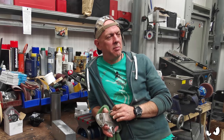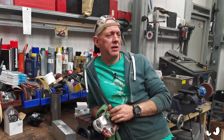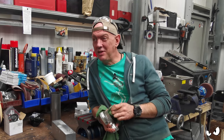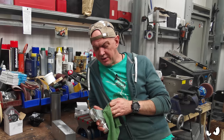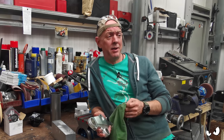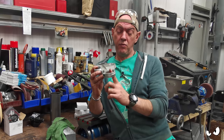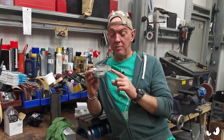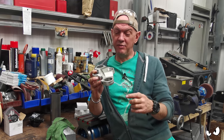So you can look at a bike and you think, well, the forks are just parallel to the steering stem, aren't they? And you look at it and you think, yeah, it probably is. Well, it ain't necessarily. The old 99 R1 that I had and the 2000, they were all straight yokes, didn't have offset yokes, but it was screaming out for a set of offset jobbies. And what that basically means is that your fork leg comes down here and your steering stem comes down here, but you can offset them. So the angle of this hole could be different to the angle of this hole.